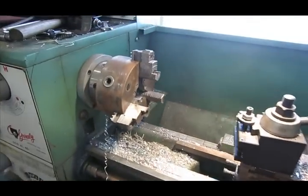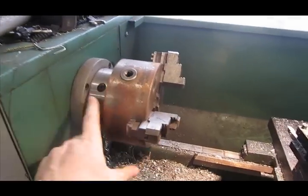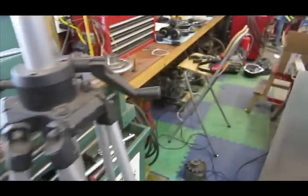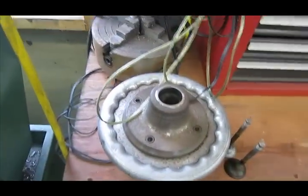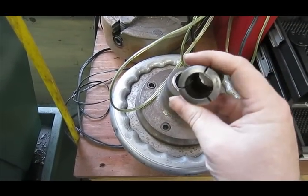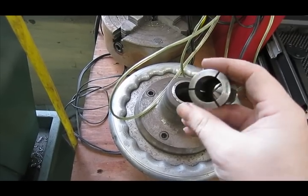This is a lathe, an engine lathe. This is called the headstock — the headstock is right here, and this is the chuck. The chuck connects to the headstock. This is a three-jaw chuck. Other common chucks used on lathes are what's called a collet chuck. A collet chuck has a piece like this that goes inside, and it's good for holding smaller parts or parts where you don't have a lot of area to grab, because it has a lot of contact area in the circle.